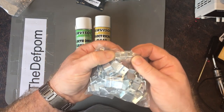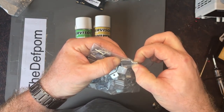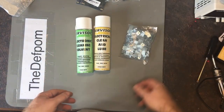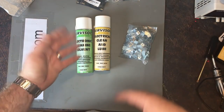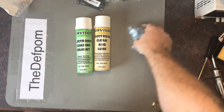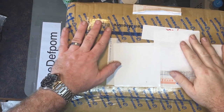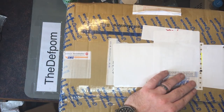I mean, the transistor itself should be able to take it, but you just want to give it an easier life. Right? Such as in the Fluke, there's a couple of transistors in there which I'd like to do this too. Which is actually why I've got them. It's just a bracket, but you can bolt that through onto the transistor and that acts then as a heatsink. So, you know, they'll get used. At the very least, you can use them as bolts to clamp them with the heatsinks, which is what they're meant for, but anyway. So that's that.